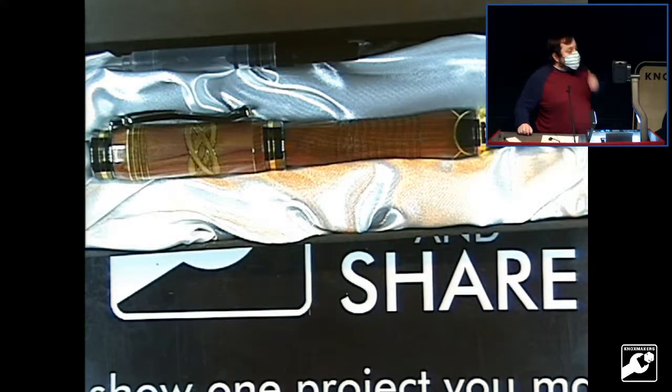So the reason it took me so long is I went through 4 generations on this pen. Funny story, brass doesn't like super glue. Maybe it likes it just fine, but it won't stay with it. So when you glue it together, you put it on the lathe, you touch it with the turning tool, and everything explodes in your face, and pieces shoot everywhere, and it's terrifying. But at any rate, I finally got the thing put together, all in all probably about 30 hours.